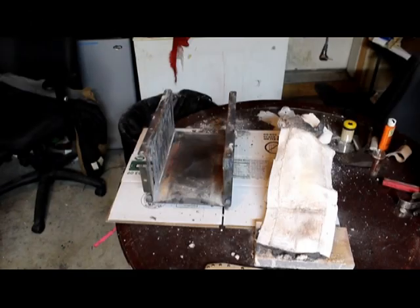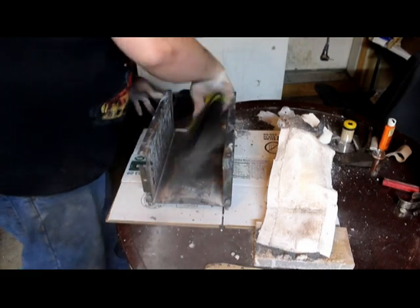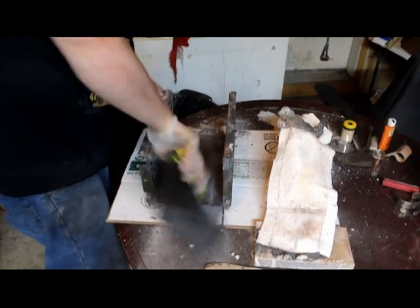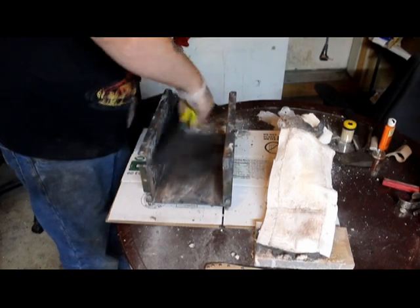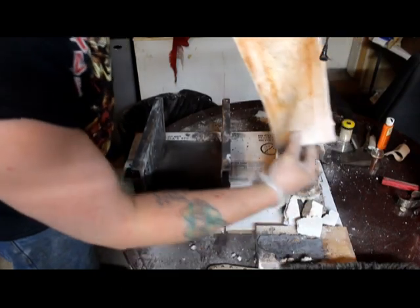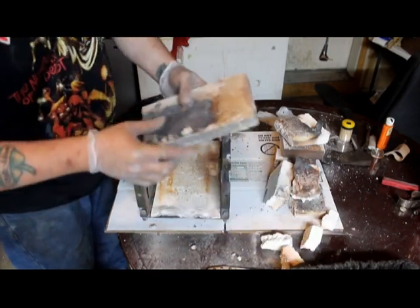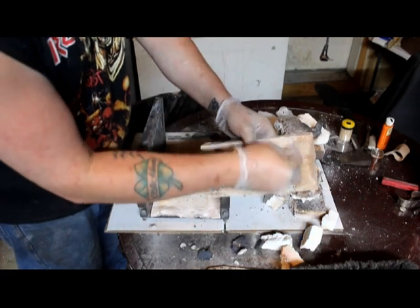So I'm going to grab my little makeshift foxtail and sweep out the bottom of the forge, get all that dust and excess refractory and little chunks of broken brick out of there, just so they don't get in the way of the process at the bottom of the forge later on. And right now we're going to put that K-wool pad back down. And we'll grab those bottom bricks and chip them clean with a masonry chisel and get all that crap off from forge welding.